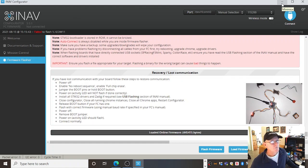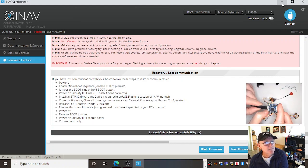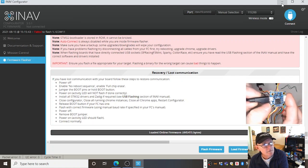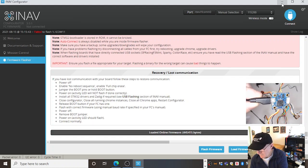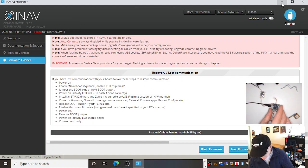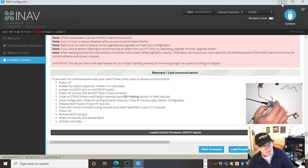I'm going to disconnect. You should see the light go out. Hold the boot button in. Now there's the boot button just there on this board. Just there, where my thumb is and my screwdriver. An option is to hold that in. It's got to go into what's called bootloader mode. And if that works when I plug this in, I won't have to use Zadig